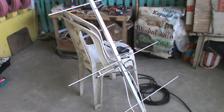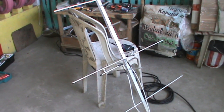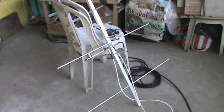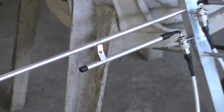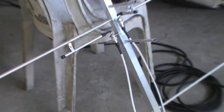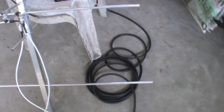This time let's continue to work on this antenna from where we left off — that is the addition of the gamma match and the tuning stub. This antenna now has a gamma match connected on the VHF side in the tuning stub, and also a gamma match in the tuning stub on the UHF side. It's now connected by the phasing harness running to the feed line, an RG8 coaxial cable going to the vector impedance analyzer.